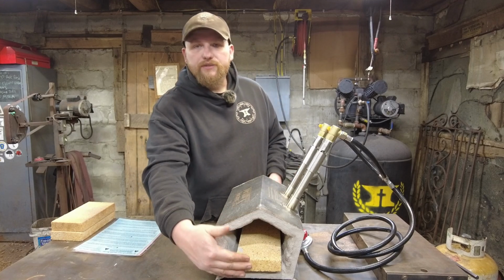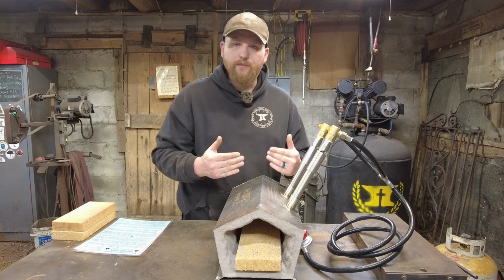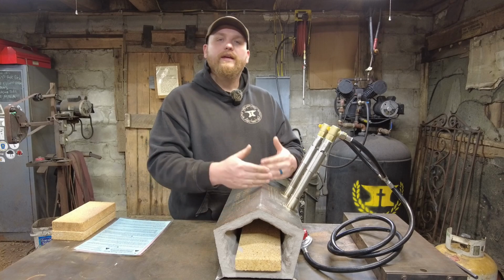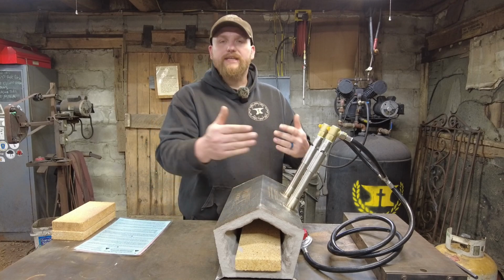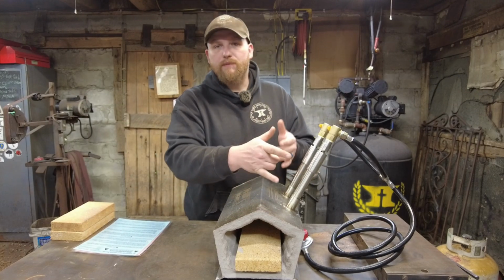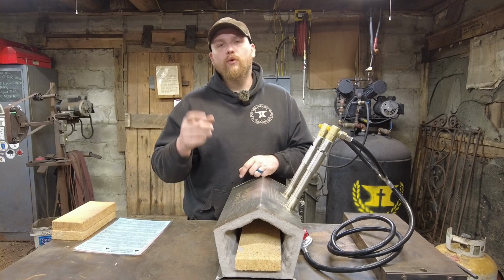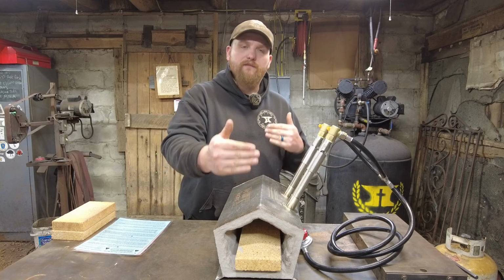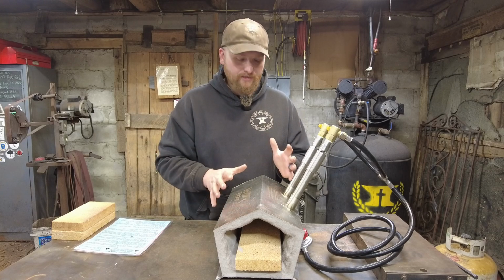The firebricks are a little too long for the firebox. With this being a 2-burner gas forge, I would personally have liked to see it be roughly double what a single burner one of their gas forges would be, and to have these burners spaced a little further apart. It would give maybe 2.5 to 3 inches more of burner box space, and still be a really solid gas forge.